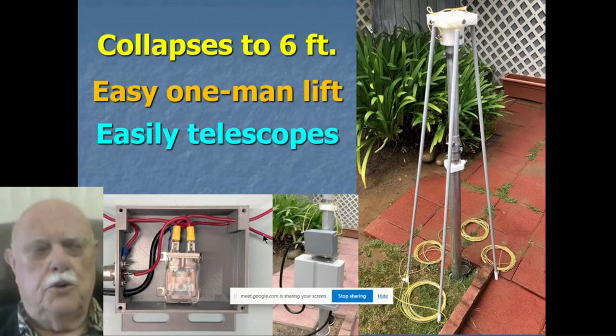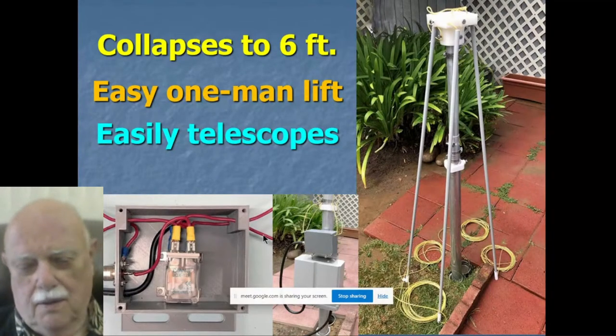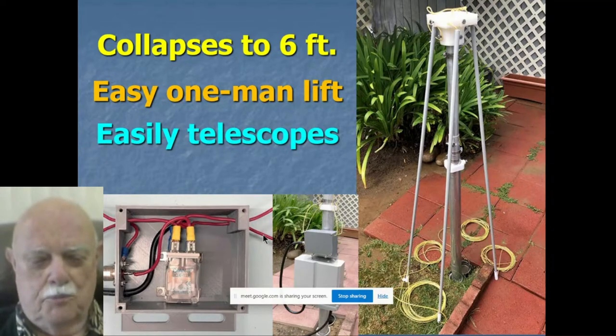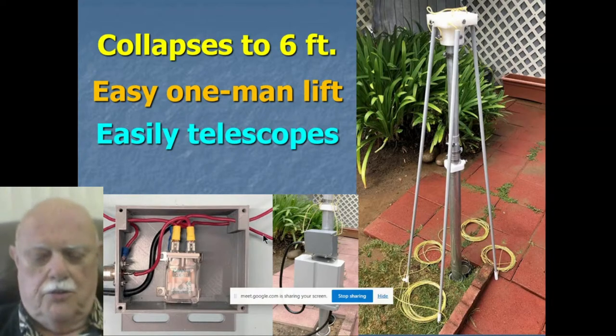This allows me to reverse one of the loops. And what that does is it rotates the directionality of this antenna. Remember, this is a directional vertical, unheard of term, a directional vertical. But it has a nice broad beam, so a 90 degree rotation is sufficient to pretty much cover anything you want to.